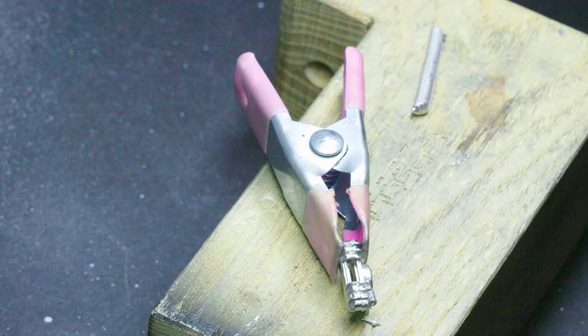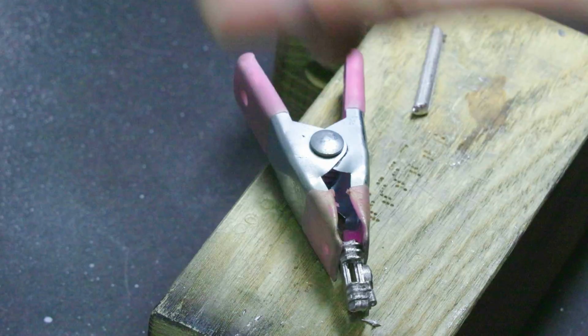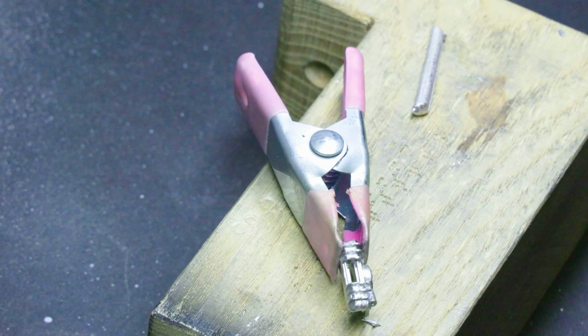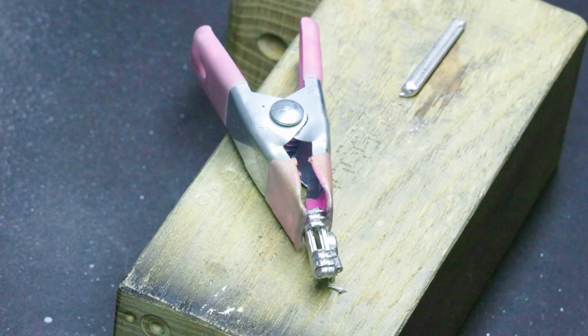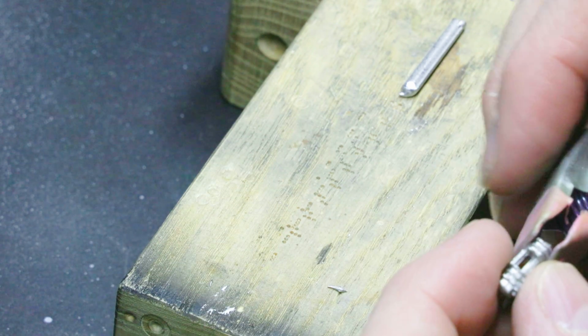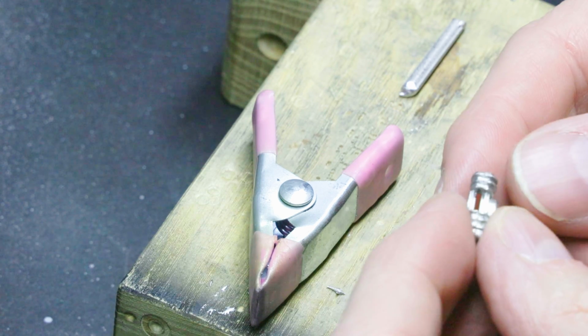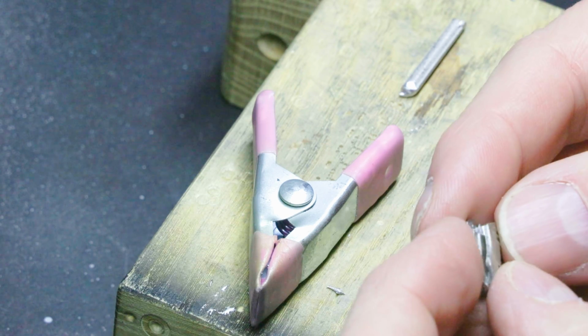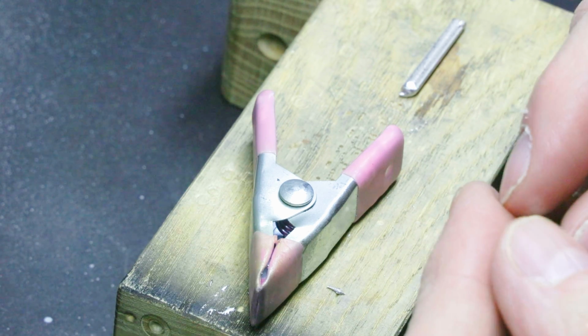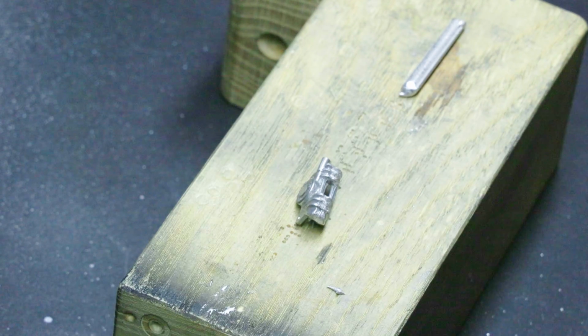Anything that can be soldered can be soldered, if you know what I mean, from the tiniest little piece to great big pieces. You can solder them all together, really. Obviously, you can't solder after you've painted something, so the only time you can really solder is in the bare metal state. So I usually try to do sub-assemblies like this, all obviously the same color, so this is where it's ideal to solder. And it's more robust. That's the main reason why I like to solder. It's more robust, and then you can work it without any fillers. So anyways, there's that. Let's head back to the bench.